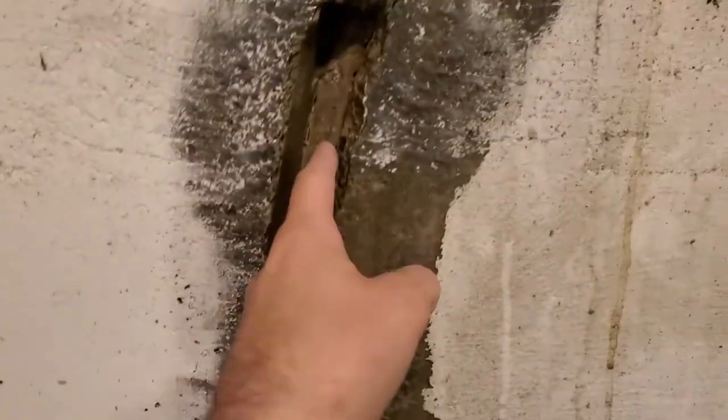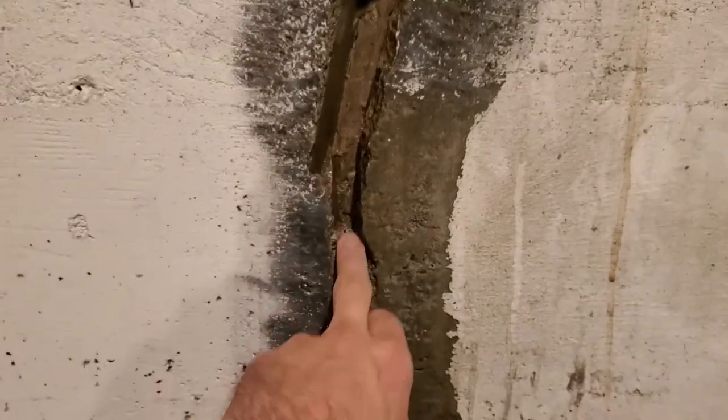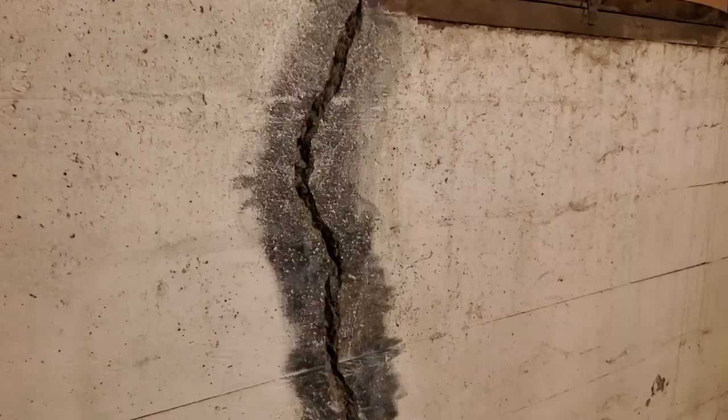About ready to lay the hydraulic cement. I noticed that back in here this wood — if it is wood — it's rock solid, I can't even hit it with the chisel. Doesn't really matter; this is deep enough. We're gonna cover this up. Like I said, this foundation has never leaked, so this patch job should do the trick. I think I had a little too much water again, but it's better than the last batch — not nearly as soupy.